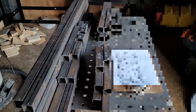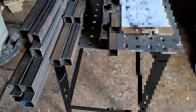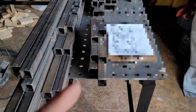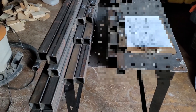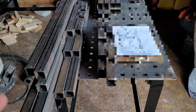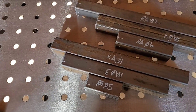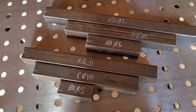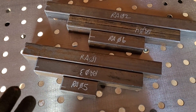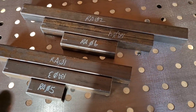Now that all the cutting is done I need to clean all the edges and set up for welding. I did pick up a table not too long ago — it's not necessary but it was on sale. I'm hoping to use it to help set these pieces up. For the starting point I'm going to begin with the rear A-arm jig because it's smaller, has the least amount of pieces, and will let me verify my settings are good. I'm going to use two pieces of scrap metal to test my MIG settings, checking for good heat and penetration so the welds are solid.